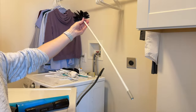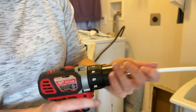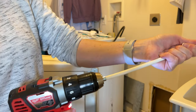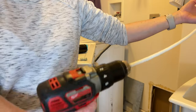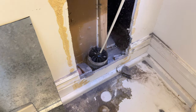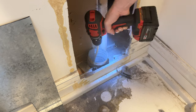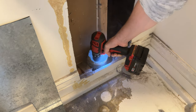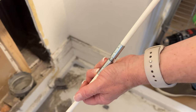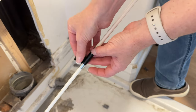Next I grabbed our kit that attaches to our drill. It's pretty easy to use. A lot of professionals say they don't want you to use these, so you decide if you want professional help or to do this yourself. A few tips: make sure you do not turn your drill counterclockwise, otherwise it will unscrew and get stuck. Don't force it in or out — just slowly move it in and out of the duct, going a little bit deeper each time. It's also recommended to use electrical tape between the links, and I just folded it over on the end to make the tape easier to remove.